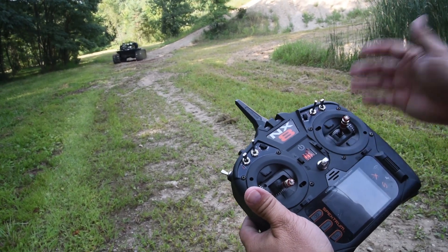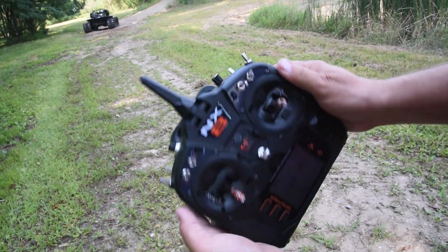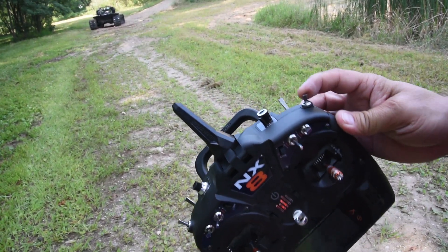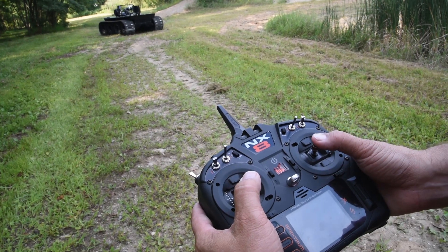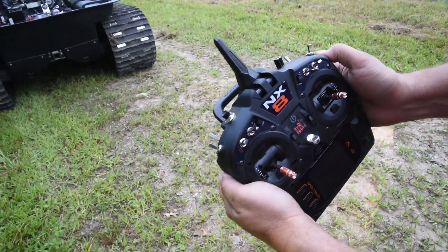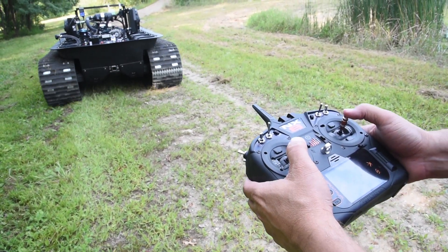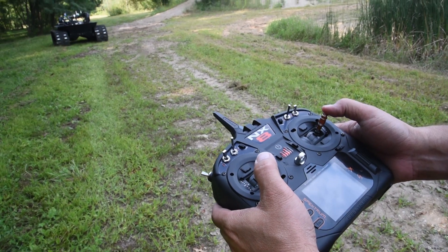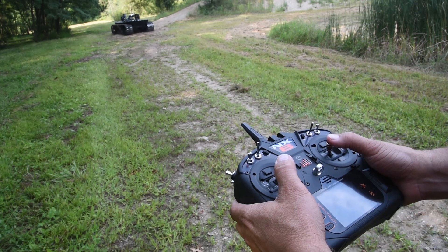You must always come to a stop before you switch from forward to reverse or high to low. If you flip the switch while it is driving, it will not recognize the command until you come to a stop. We are going to take G — put it in neutral just to show you, see it goes nowhere. That is also your parking system when it is sitting there running. Then to reverse — that is reverse, and everything is opposite, so to the right goes left. Now putting it into forward and high range — it is a little less sensitive for turning, and if you go full hard stick it just skid steers gently. This maneuver is for when you are running high speed and do not want the machine to jerk.